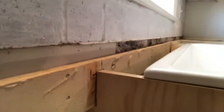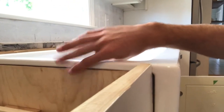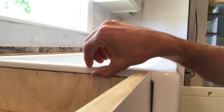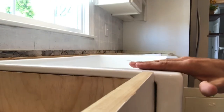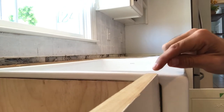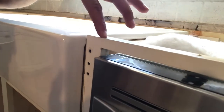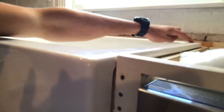We didn't do anything for the back side of it — it's got enough support on the sides. Our intent isn't to only support from the sides because that lip is only five eighths of an inch, and this is going to be mounted underneath the countertop. It's sitting a sixteenth of an inch below this cabinet line right here — same thing on this side too.